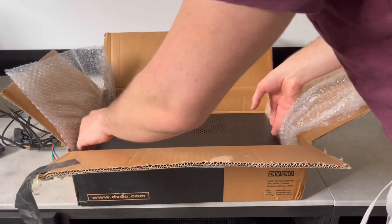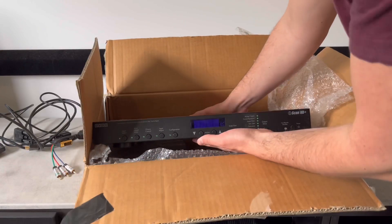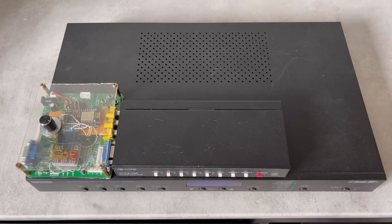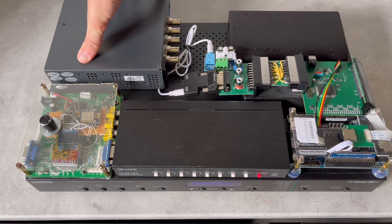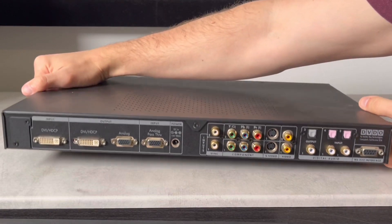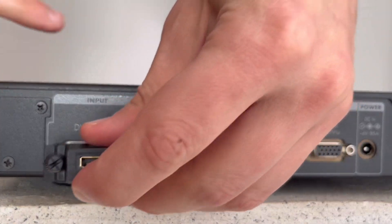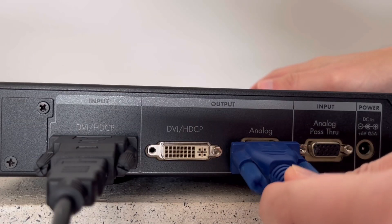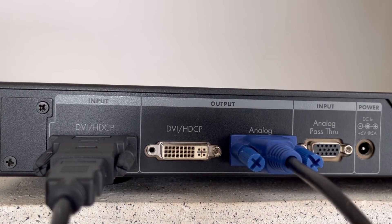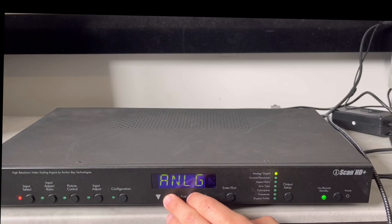A premium video processor that won't downscale to 240p out of the box — and a huge box. This unit is almost bigger than the collective scalers featured so far, with a buffet of standard analog, VGA, and DVI inputs. I chose to send HDMI through DVI and output RGBS through the VGA port, so there's no external transcoding. It also comes with a remote to complement the buttons on the front.